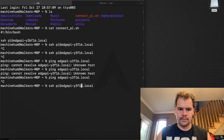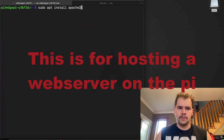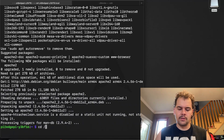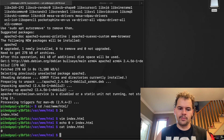Now I have the Pi up and running. The first thing I want to do is build a bunny feeder. I have a USB camera I want to plug into the EdgePi and run an image classifier to detect bunnies. When it sees bunnies it will activate a relay, turn on a motor, and dispense treats. I installed Apache 2, put in the hostname of the EdgePi, and the web server is up and running hosting from /var/www/html.